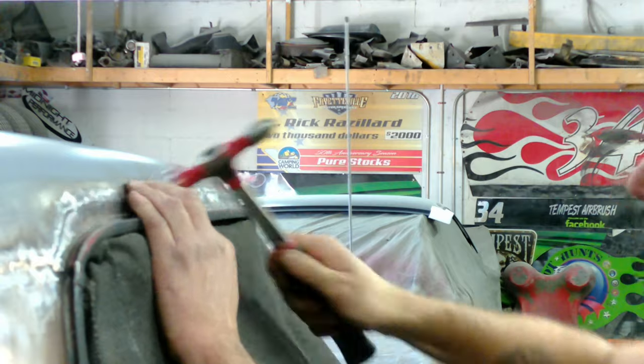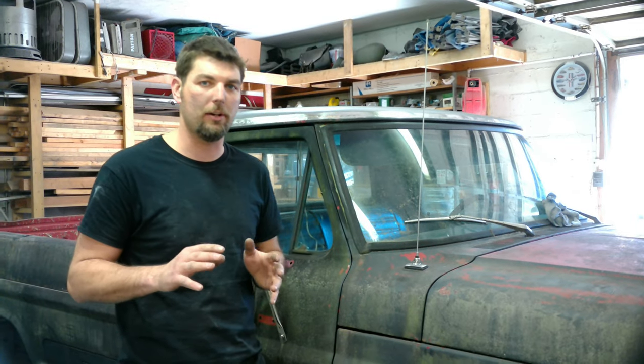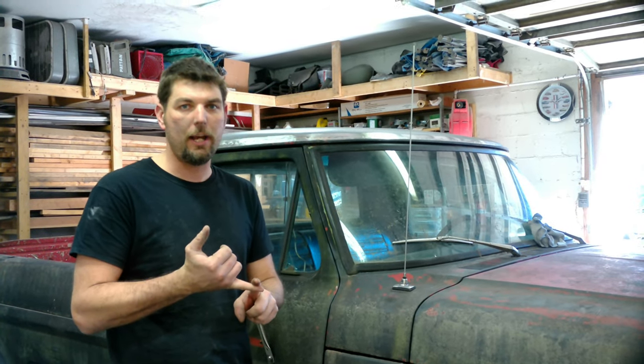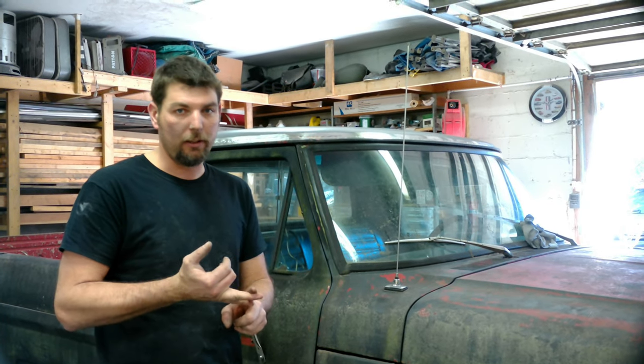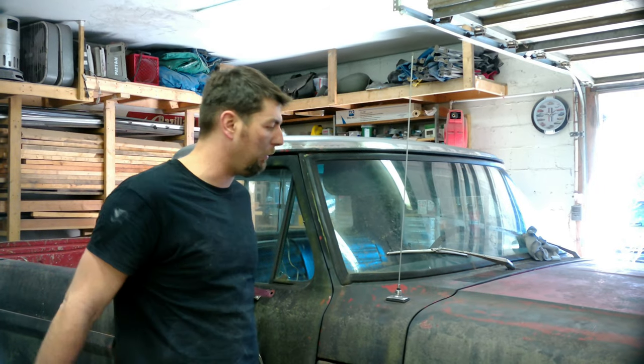I'm done with all the metal work on the 68 Ford. The roof came out really good — I'm really happy I TIG welded it. I'd rather install it a different way, and in a couple of months I'm putting a roof on a Barracuda with a brand new roof, so I'll show you how it's done the right way. We had to do this because it's what we had to work with. The TIG welder was key — just slow and steady. I really liked the bronze rod that I used for the first time in the brazing; I think I might use that again on other projects. It worked really well for filling gaps and keeping the heat low. What I'm going to end up doing: after I show you the metal work, I'm going to use some all-metal filler after I DA on 80 grit, then basically high-build primer, lock it down, get it smooth and flat — and then whatever she decides. Maybe she'll let me work on the rest of the truck and we'll fix it up; if not, the roof will be done.